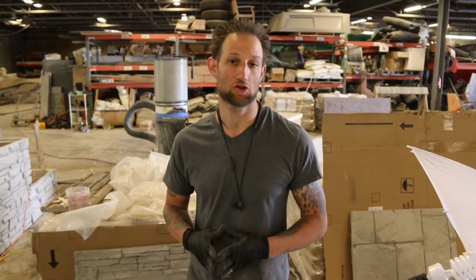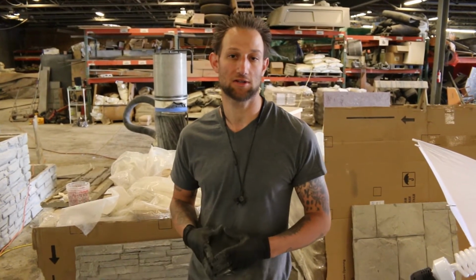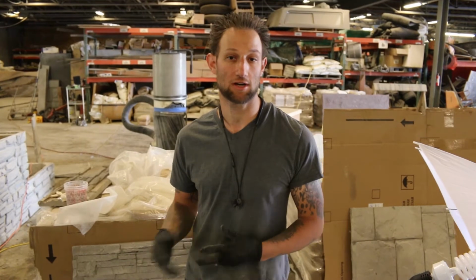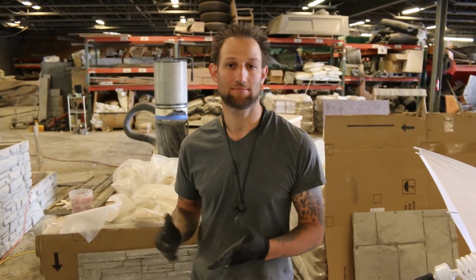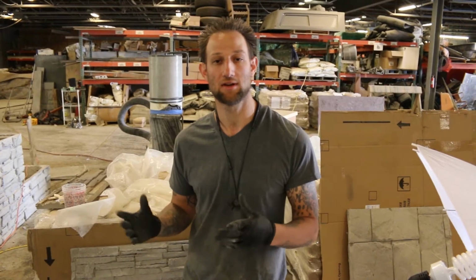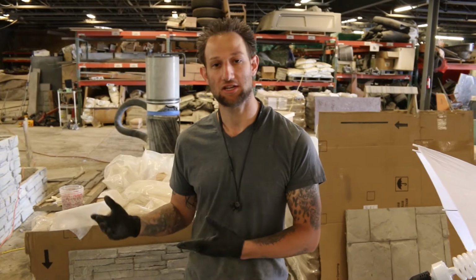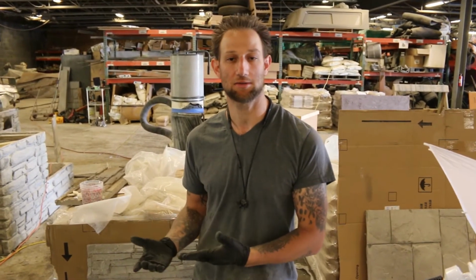So the first thing I always recommend is creating sample panels for your customers. I always recommend starting with 3 or 4 standard color options that you're going to offer your customers, and these can be in 2x2 square sizes of panels that you can cut and pre-color, so that you can physically demonstrate these, so that the customer is aware of what they're going to receive and what the end result of the coloring of the panel will look like.